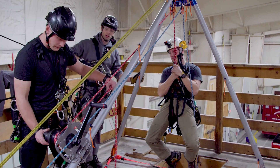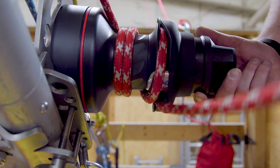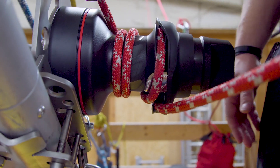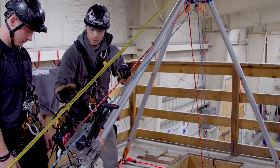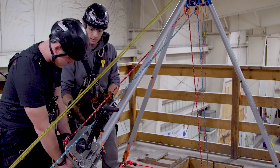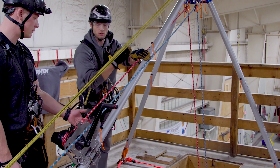When Dale stops there's no reason to have to dog off the rope. This actually creates a full-strength anchor because we're using essentially an advanceable tensionless hitch on the winch itself — no knots to degrade the strength of the rope, so we call it a full-strength system. Everything is locked off by the lock head, and on the lowering, all Dale is doing is moving the knob to control the friction to allow for descent.